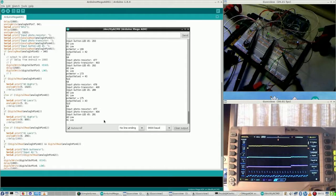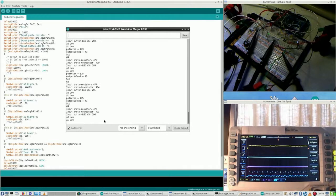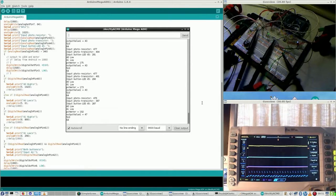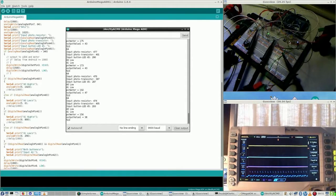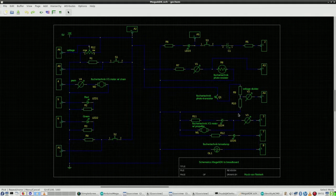Then, what is next? Well, checking the circuit with the LED and the motor, because I still don't like that. Why is it working on its own instead of with the transistor with the button? So if I pull up schematics again, this is the motor and LEDs, so they are both activated the same way and coming from output 3. This is input, this is the output.